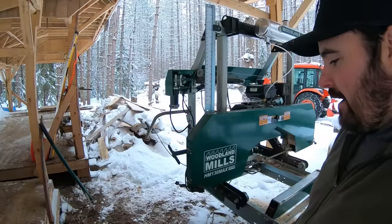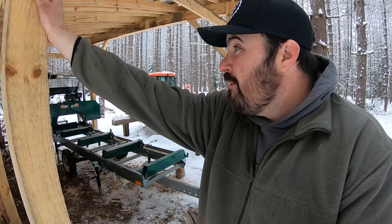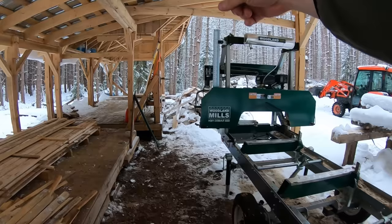When I ordered it, it got shipped to me, I was really excited. I also ordered a bed extension at the time — no trailer, just the sawmill sitting on a platform. But I didn't have a platform yet. What I had was essentially this forest — I hustled out here, cut down a few red pines, used them as posts and rafters, threw down some tin, and that was my lean-to shelter. Except I didn't take the bark off the logs, which was my learning curve — leaving bark on brought in bugs, and over several years I started questioning the structural integrity.